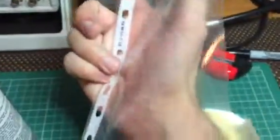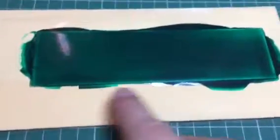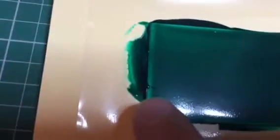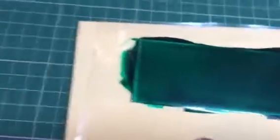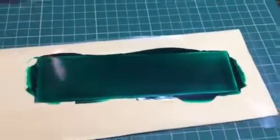For bang for the buck, these plastic pockets - bought in boxes of a hundred for a few pounds or dollars - the plastic is great. Using the whole thing as a sandwich to produce the covering on the board seems to be a good idea. So that's my first successful prototype on this scale with this method. To clean up the edges, this stuff is still wet - either cure it longer then break it off, or wipe it away with acetone. The dry ink is impervious to acetone but wet ink will wipe away. Result! Thanks for watching, cheers, bye.